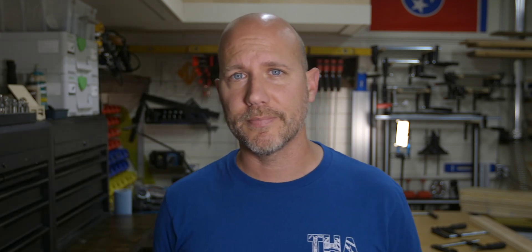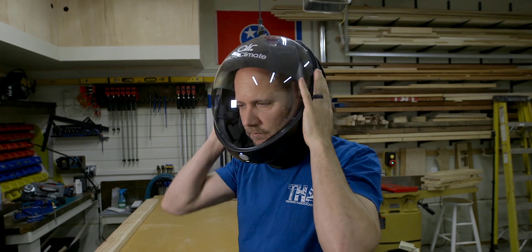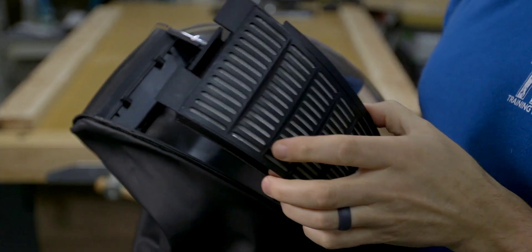However, if I'm involved with a big long project that is really just dust consuming, then I'll grab for something a little bit more robust. This brings us to positive pressure masks, or powered respirators. These systems use a fan or air supply to push clean filtered air into the mask or helmet, creating a slight outward pressure. That means air leaks out, not in — so it's much harder for dust to sneak past the filters.